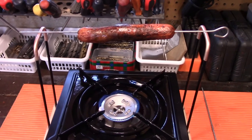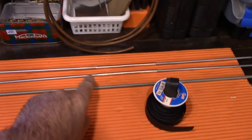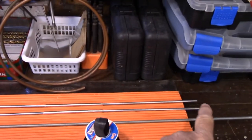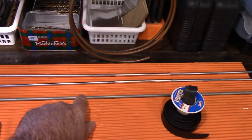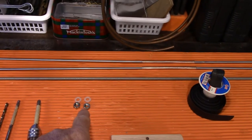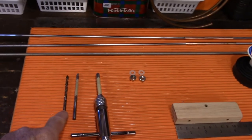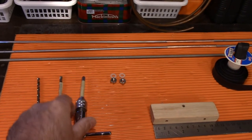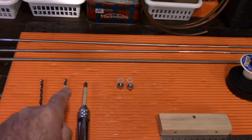Now I'm going to show you exactly how I built this. The first thing you have to have is a plan, and everything is laid out here. This is just 3/16" rod with some copper tubing slipped over top, and I went from this end up to the copper tubing 8 inches. This is some shrink tubing, and this here is the quarter inch all-thread. Here are the two nuts I used and some plastic washers. And here we go with a 3/16" bit for the rod and a 13/64" bit for a quarter-inch 20-thread tap. I put tape on here so I know how deep I have to go.